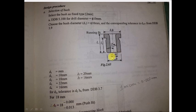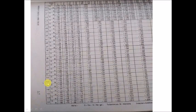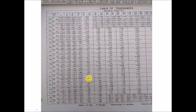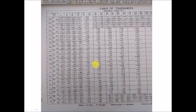Now for D2: the dimension is 18 mm. We have to find D2 H6. Go to design data book page 3.7. For D2 = 18 mm, D2 H6 is 0.0 / minus 0.013. We will go for a push fit. The drill bush design is done.